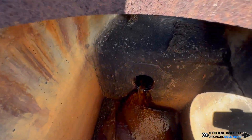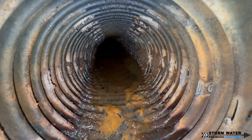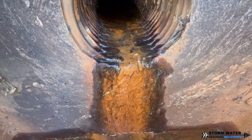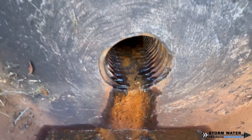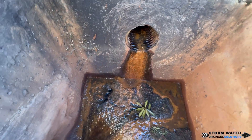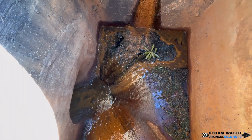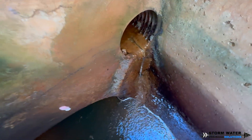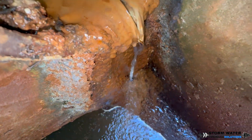The examples I'm going to be showing you in this video are of both PVC and corrugated French drains. These French drains run along the roadway and they connect into the storm drain box where the mainline culvert pipes run. These French drains are designed to pick up excess subsurface water along the roadway to dry the area out. Both systems have iron ochre buildup in them. Iron ochre does not discriminate against pipe — it does not matter what kind of pipe your drainage system is built with. It will grow in any kind of pipe.